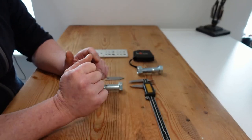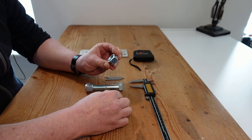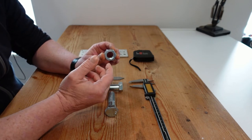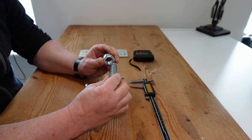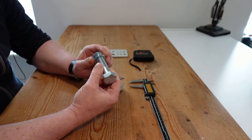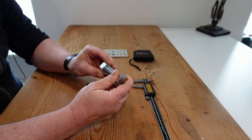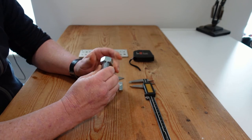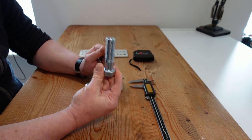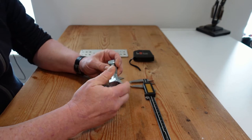In terms of measuring nut sizes, the easiest way is trial and error. It is possible to measure the inside of a nut thread with calipers and thread gauges, but you're more prone to error. The easiest approach is to identify the bolt first and then match the nut. When inserting a bolt into a nut there should be no undue pressure — it should roll up fairly easily. If it starts to bind after a thread or two, it's not the right one. If all else fails, bring the bolt to a hardware store and compare it there.